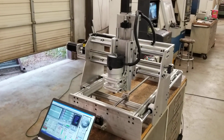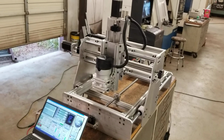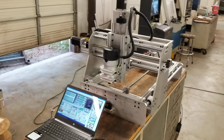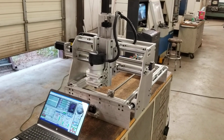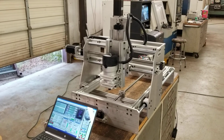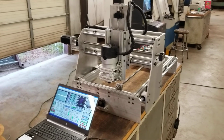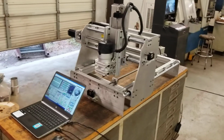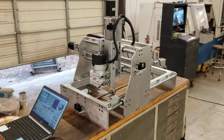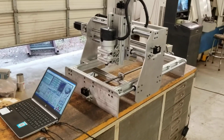which is exactly what we're going to do today, is build some parts on this table. That's when I'll do the actual calibrating of the steps per unit. Right now I've got them set at what they should be. We have to do backlash and calibration to get our parts really accurate within a thousandth or two. For this type of table that's not unrealistic, especially using the C7 ball screws. Those perform really well.